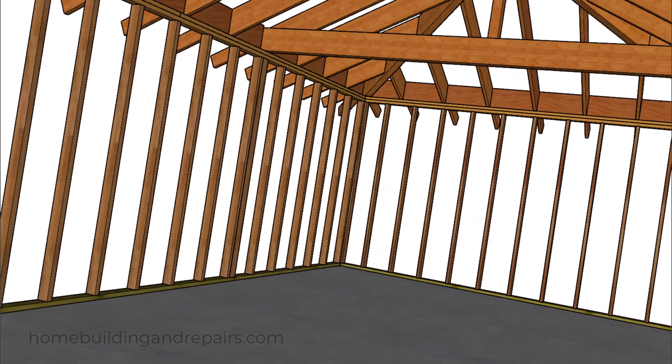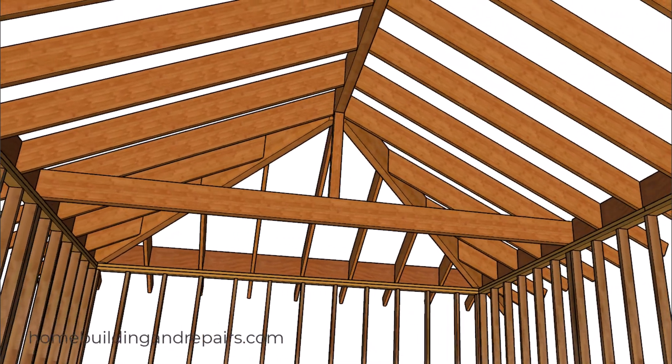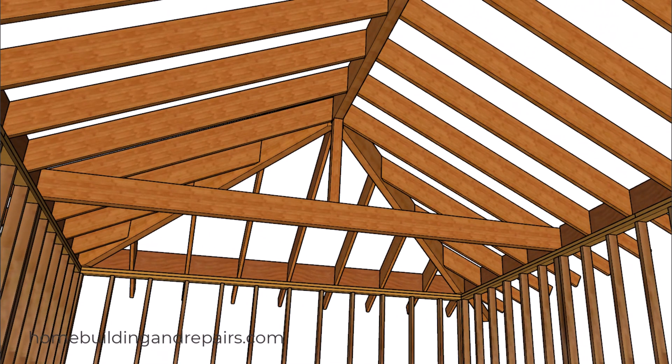Let's go ahead and take a look at it from the inside, where you will be able to drywall the underside of the fill rafters, and drywall or plaster around the hips, the post, the beam, and the rafters. And if you don't want the post, the beam, and the larger hip rafter beams, then all you need to do is use a gable roof — do not use a hip roof.